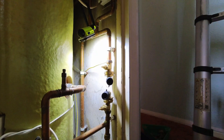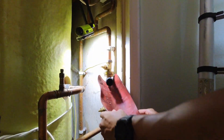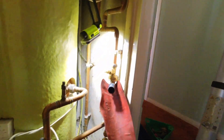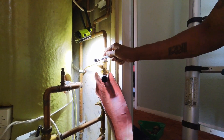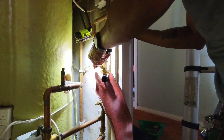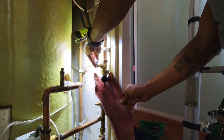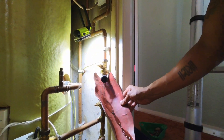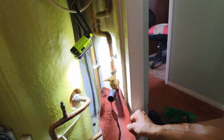I've changed the pump valves and now I've taken the bung out of the F&E tank. I'm going to use this gate valve to drain the water from the F&E tank into a little collapsible bucket. And this is our cold feed pipe so I can cut in my butterfly valve. Let's have a look - this water is going to be filthy. Look at the colour of that - that is black gold. I'm going to let the F&E tank empty out, cut in my butterfly valve on the cold feed, and then I think we're ready to start flushing. I've also removed the bypass and capped it off - there's no need to refit it.